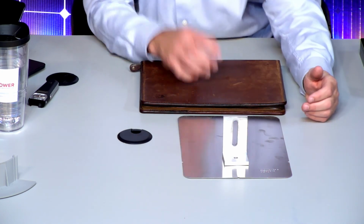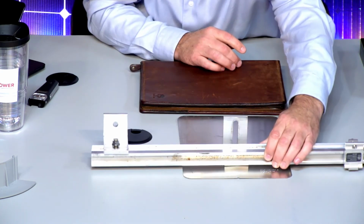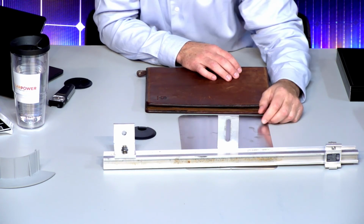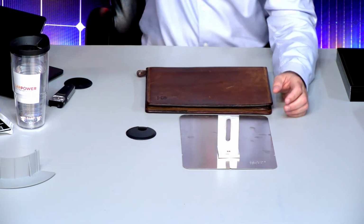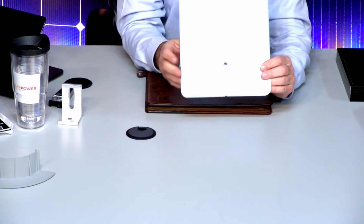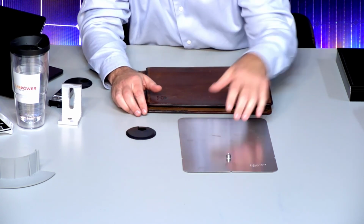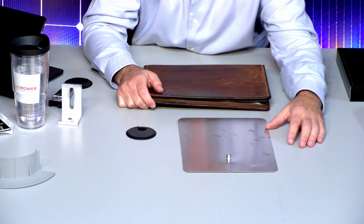The problem I have with that is if we're going to mount a rail on top of that, you have a very rigid aluminum rail that doesn't exactly flex. So if we followed the shingle line and it's all up and down all over the place, and we try to put a rigid, solid piece of aluminum on that, it doesn't match up very well. So what we do is go back to the notches on these flashings. These notches will line up with a chalk line, so we'll put a chalk line across there. Usually they're pretty close. They'll use a straight chalk line, and then they measure down, and the installers know how far they've got to go down for the next rail.